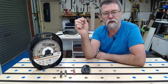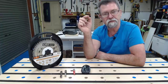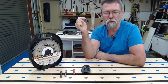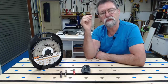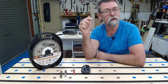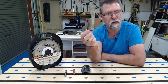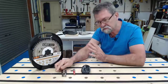Now, the boards I'm going to do the comparisons in today are some plywood. It's going to be quarter inch ply, and it's a 5-ply. So the laminations are thinner than 1/16 of an inch, which is around just over a millimeter thick each lamination. The reason I'm going to do that is so that we can see any imperfections in the base of the cut that I create with the Dado. So it'll be good fun. Obviously, my thoughts are I'm going to get the absolute best result from this guy. This is a spiral down cut, and I think that's going to deliver the best result. But nonetheless,